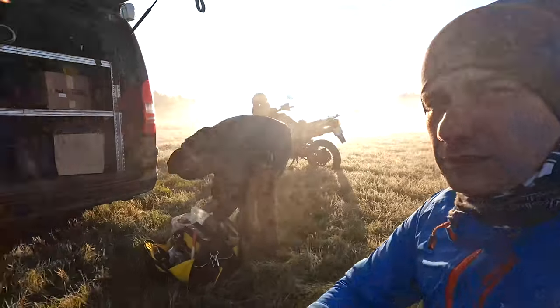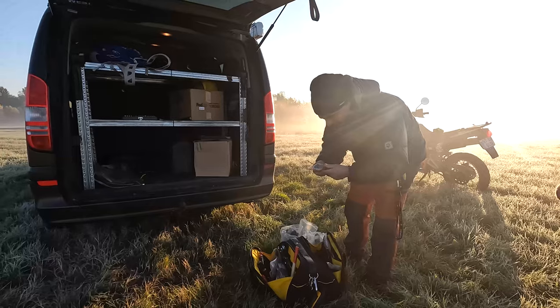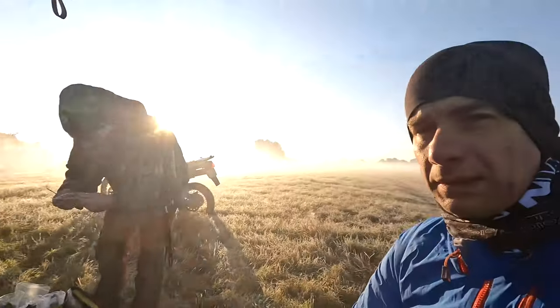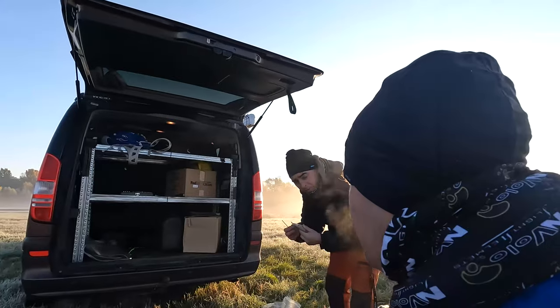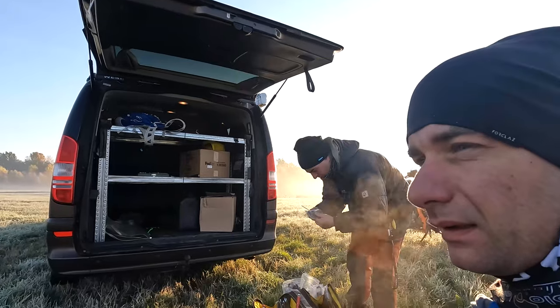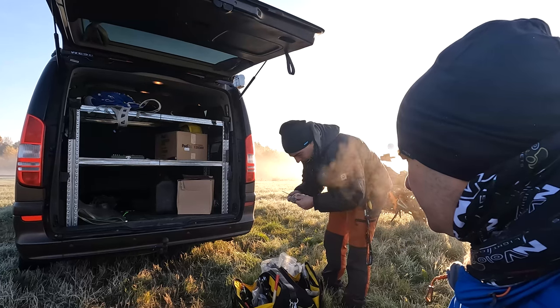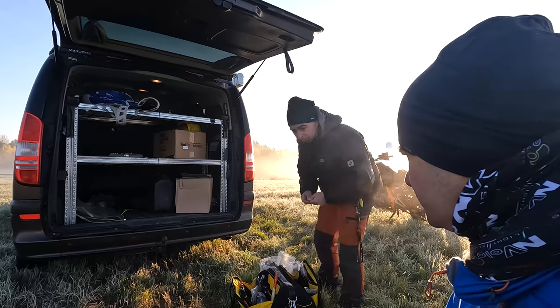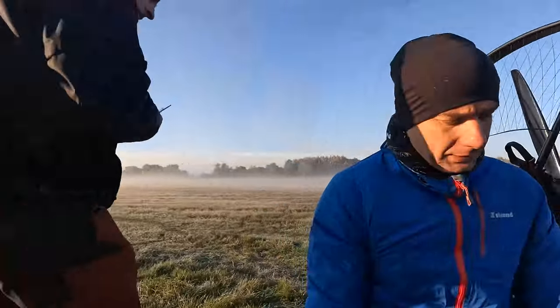Stefan, what's your take on this? Well, I will just try to make the spring a little bit stronger to extend it a little bit, but I don't know, we will see. I guess it's because of the cold and we have all the grease and stuff inside the throttle, and I think that becomes thicker, and that's why the movements are slowed down. Do you think a different Bowden could help? I guess so. Not the brake Bowden, but the derailleur Bowden, and better quality ones, yeah. Because there are polished cables, this is by far not a polished cable.